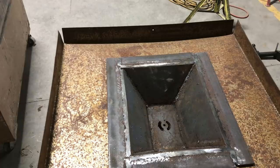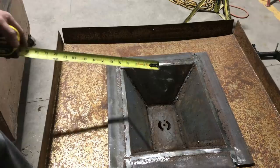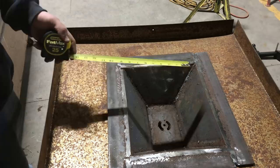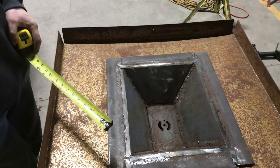So, of course, around the outside, it's 2-inch angle iron. We built this so that I could pop this right out. This top right here can come off. That way we can rebuild the whole thing. You've got to remember, coal's pretty darn hot. Now, this half-inch plate steel will last a really long time, and I have enough of it left over to build one more of these if I need to. I've spoken with people who've done it out of half-inch plate, and they've been using it for 10-15 years with no issues. It hasn't burned out or anything like that.